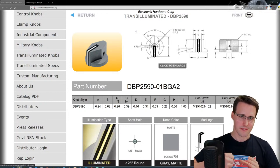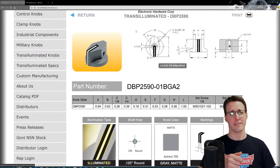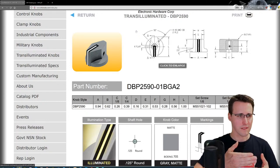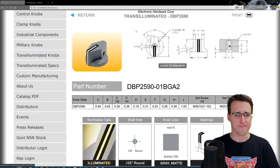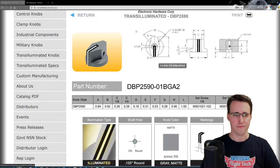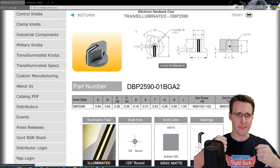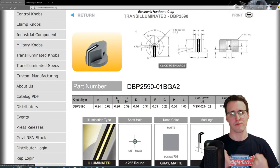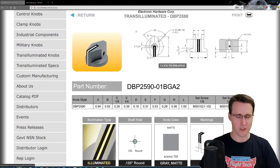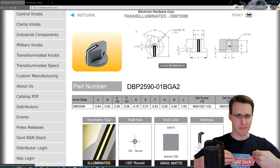But the force pushed it a little bit in one direction, and it can happen that the fitting isn't tight enough, and it can slide through when you are rotating the knob to the end stop, and then a little bit too far. Or if the shaft is really short and you can reach the shaft only at the very top of it, then one screw can't produce enough pressure to hold your knob on the shaft. So use two screws, and then you have divided the force evenly.